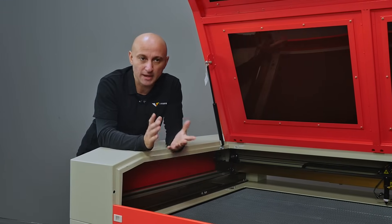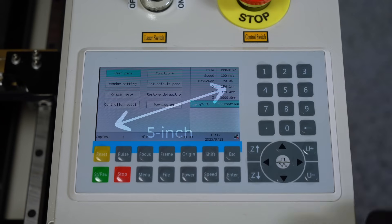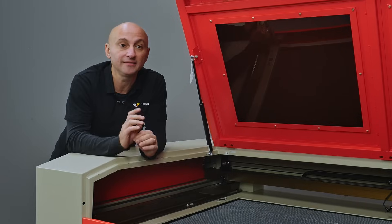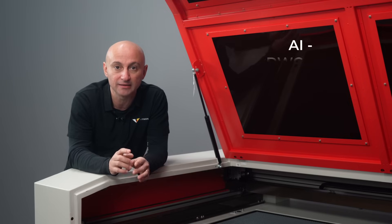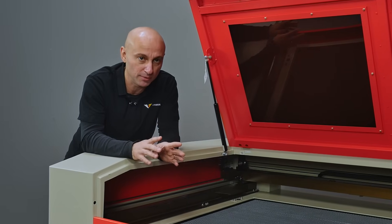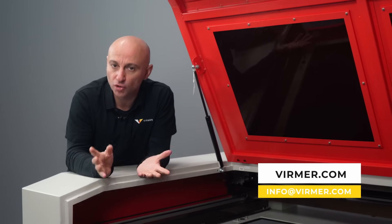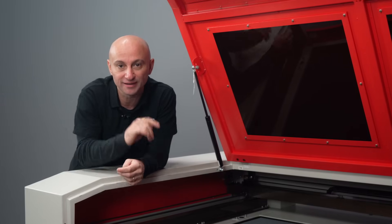Let's talk about the control system and software. Like many advanced laser machines, the Watson 1610 LT uses the Ruida 6445G as its control system. The machine is operated using the RDWorks program, which allows you to create, edit and execute files for laser cutting and engraving. The program supports all basic graphic formats: AI, DWG, PLT, JPEG, BMP, etc. It is possible to work both from a computer connected via USB and to load control programs from a USB key into the machine's memory. If you still have any questions, feel free to ask them in the comments or call our managers — they will give you detailed advice and show you the machine in action online. See you in the next videos.